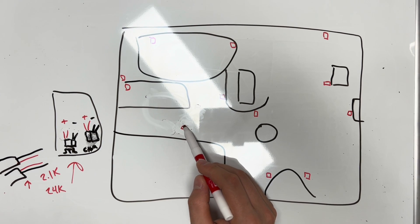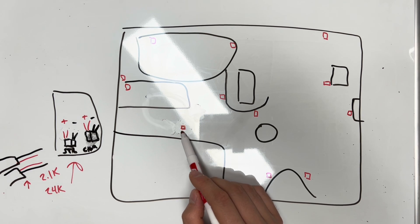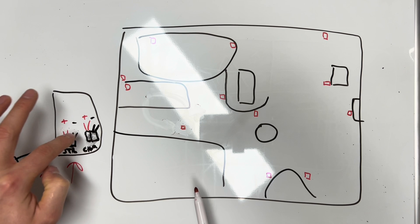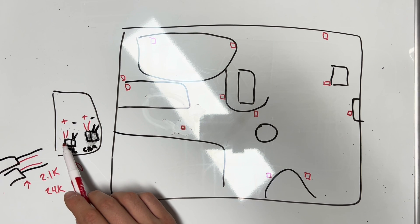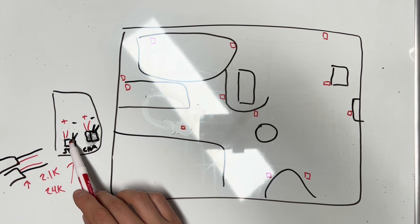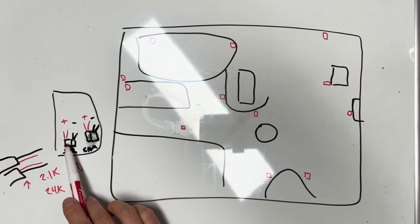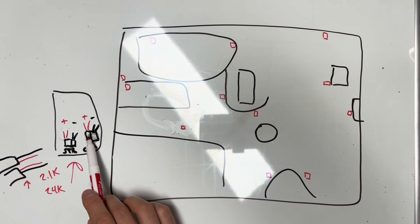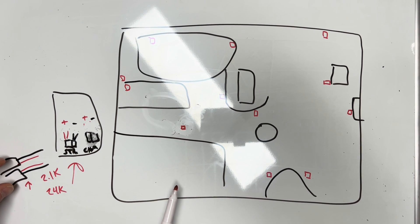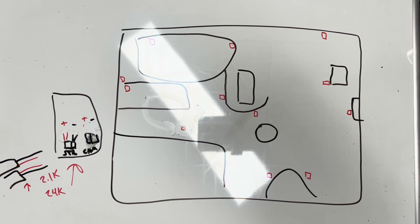We set up the toner on the first box over here. Basically we disconnected it — opened it up and disconnected the wires so they were sitting free off the back of the fire alarm device. Each device has an in and out, landing on the same terminals. Positive is red, negative is black. We took off the chime, left the wires free-hanging in free air.